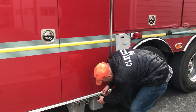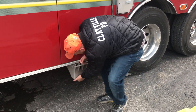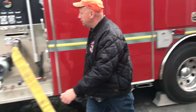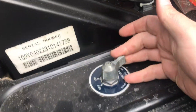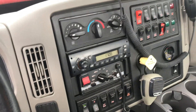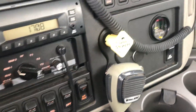Okay, so we're here. Start the truck — we're going to turn our batteries on, which is down here. Alright, she will start. Okay, we've got ignition. So our next step is going to be to actually put the truck in pump. If you look on your dash column, you want to first make sure the truck's in neutral, parking brake's engaged, and we're going to find our pump.